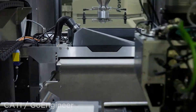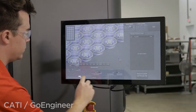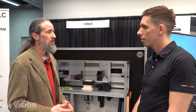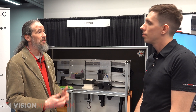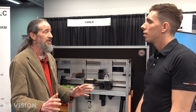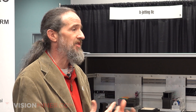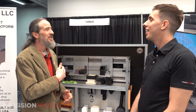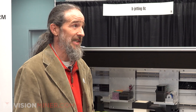Believe in binder jetting. There are some negatives people talk about — shrinkage, distortion, sintering is difficult. Those criticisms are true, but those are all things that can be overcome in a production setting. When you're really ready to make a thousand parts, you can tune your machine and your process so that you get those thousand parts reliably, but it does take a little bit of education and research. And you will have binder jetting success.